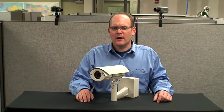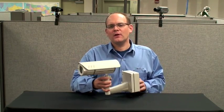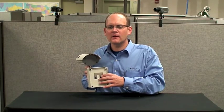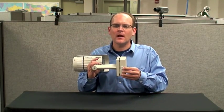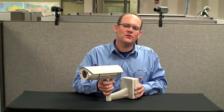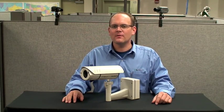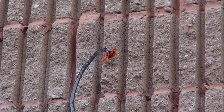Before mounting the power data back box, we need to determine if the camera installation will be wall, ceiling, or parapet, and if the cabling will pass through the compression fittings on the back or through the half-inch or 15 millimeter NPT conduit mount on the bottom of the back box. For this installation, we will wall mount the Sentinel cameras and pass the data and I/O cabling through the compression fittings on the back of the back box. After the data and I/O cabling has been pulled to the mounting location, make sure to apply weatherproof sealant in the hole the cabling passes through to prevent moisture from getting behind the wall surface.